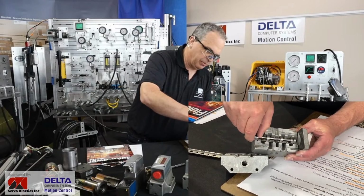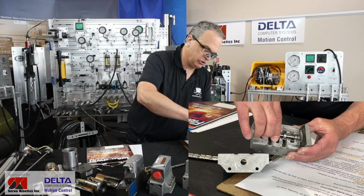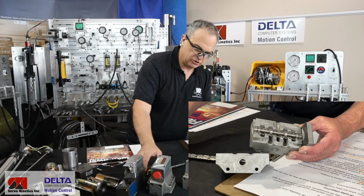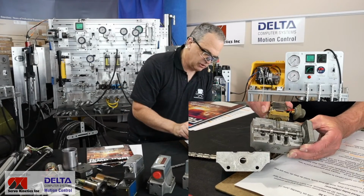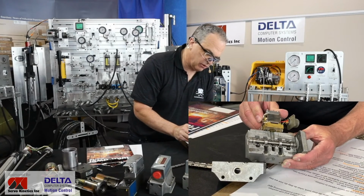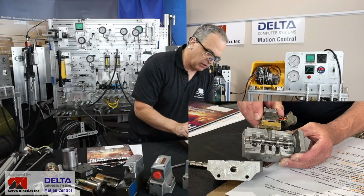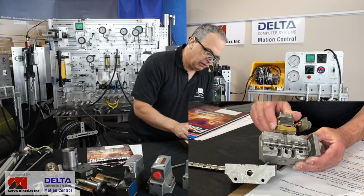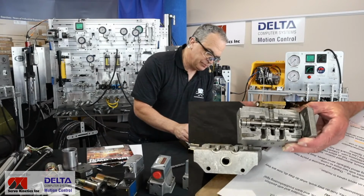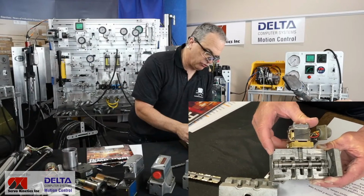Here, I'll just stack up enough pieces on top until they just start to fall out all over the table on me, which will typically happen. And let's just see what fun we can have. So there's our torque motor pilot stage sitting on top, and the little feedback wire with a little ball sphere on the end fitting into a little drilling in the spool. And so there's kind of our complete structure, if you will, more or less stripped right down.